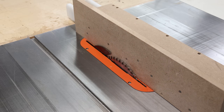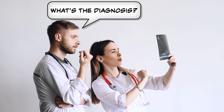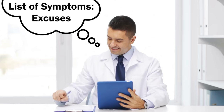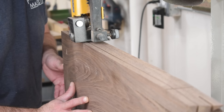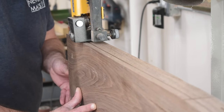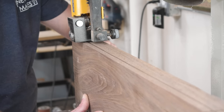Accuracy. If I need to cut a 1/8-inch wide board, on my table saw I simply slide my fence over, measure 1/8 of an inch between my fence and the blade, and go to town. Not so on the bandsaw — I'm probably going to get some degree of blade drift. It may not be a ton, but it's probably going to be there. This is insanely common for woodworkers; it's pretty rare if someone never gets blade drift at all. I've done the maintenance, watched videos, read articles — I still get a little bit of drift. And because I do, my boards are probably not going to be exactly the measurement I wanted.